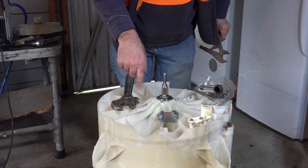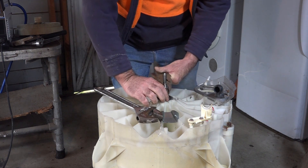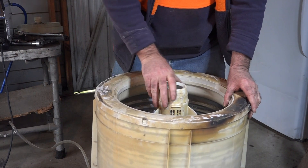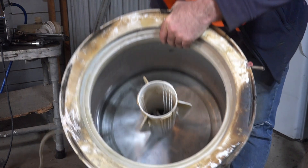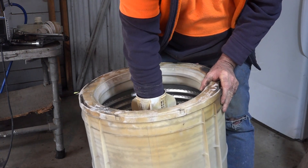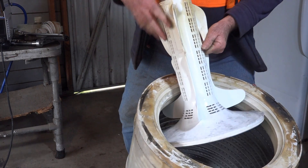Last but not least, the old stainless steel drum on the bottom. So what we need to do is grab the top of the shaft with a pair of vice grips or something and grab a big crescent like that and just give it a tweak. That's it - sometimes it's really tight, sometimes it's not so bad. Undo them like so. As you can see this is loose now so we'll turn it over. On top of the machine there's this thing where you put your soap - we'll get rid of him. Now if you look right down into here you'll see there's a plastic nut thing there. Still some water in this one, can you hear that? So we undo that plastic nut thing.